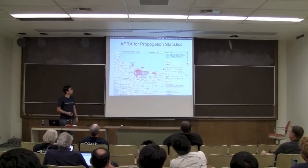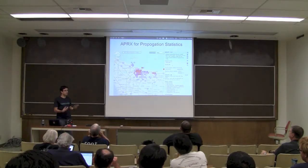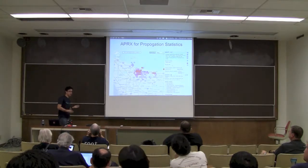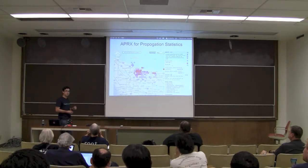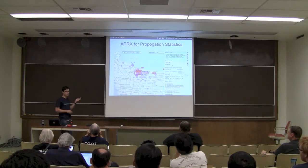So this map shows packets that I've heard directly. It can give you a propagation map, sort of what your radio can hear. I say sort of because there are so many people clobbering each other on this frequency that there might be some weak signals you can hear, but you can't because somebody sent their signal out on top of that. There are people in the amateur radio world that have beacons set up for long distance communication, and when the bands open, which means when the atmospheric conditions are such that you can actually communicate on that frequency, you'll start hearing these beacons. But I don't think you can do something equivalent with APRS because the bands are not quiet most of the time. It's a really crowded RF world.